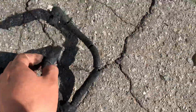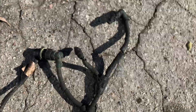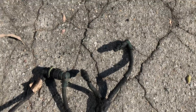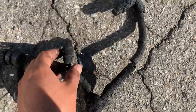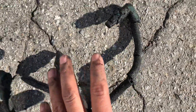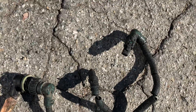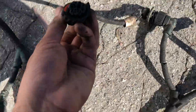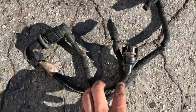These two here are for the piston coolers. Volvo has a system with piston coolers that passes oil through to the oil filter module. I've seen many Volvos leak from there too — I'll show what piston oil coolers look like in another video so you know what to look for if you need to replace them. And this one here is to check the pressure on the piston oil cooler as well.